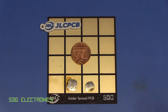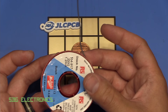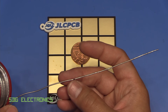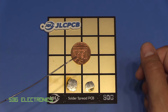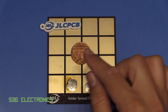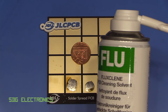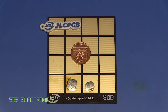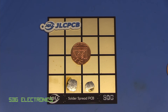We're now going to redo the 2p coin test, and hopefully everything is a lot fairer between all the stations. We're going to use some 60-40 solder, 1.2 millimetres. I've measured 100 millimetres and we're going to feed in exactly the same amount for each test. I'm going to try and feed it in as fast as possible, then remove the solder, keep the iron on the coin, and see how the solder flows. I'm also cleaning up every coin with flux cleaner to make sure there are no contaminants, and just before each test I'll clean each one up.